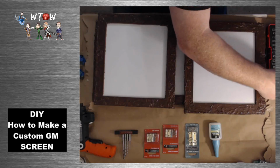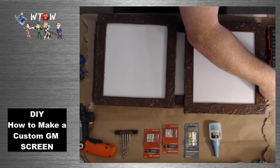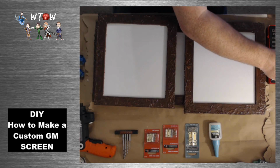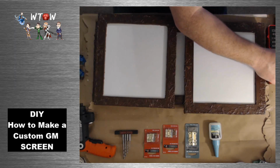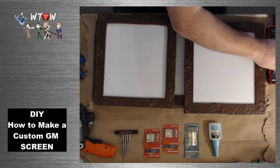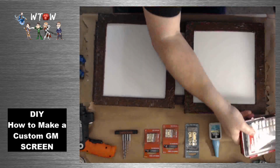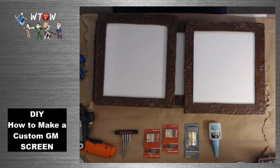So if you've watched this video all the way through, one of the addendums that I would like to make to the construction phase is where these interior doors are going to meet up and be flush with each other. Because you're adding that texture in, do a little extra sanding. And if you decide not to do a little extra sanding, I'd take another, I'd say, a 16th of an inch off of each one of those panels where they would touch each other when they're closed.